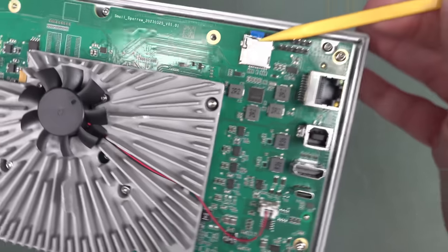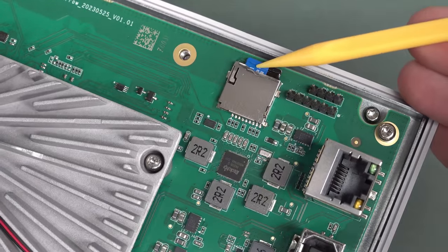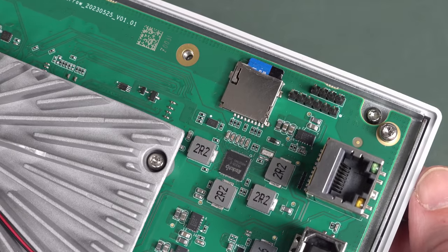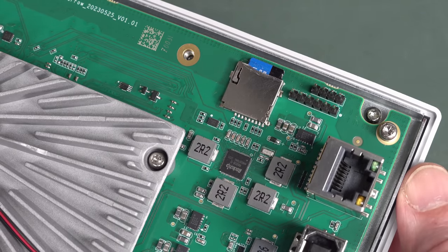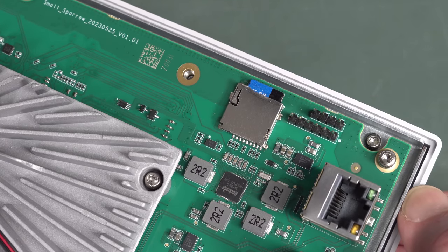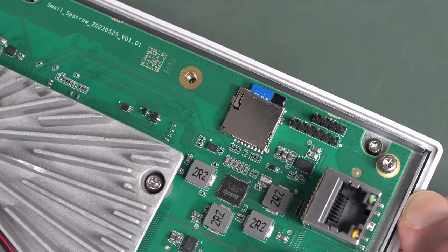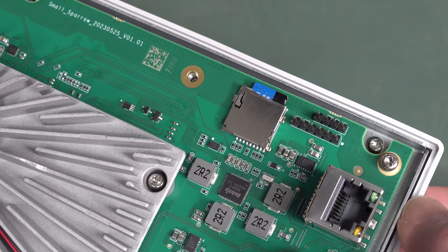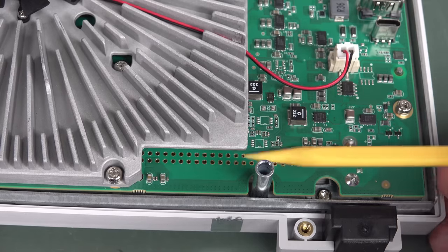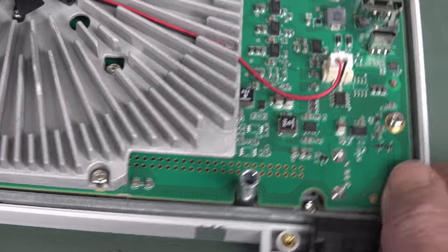Lots of power supply action happening over here. There's an SD card glued in there — they've actually glued in that SD card. That's interesting. I might have to get that out and have a read. Can we just update? Because this does run the Android operating system. Is the operating system just on the SD card? Is that a way to reduce cost? We have some headers here, and check it out — that is your logic analyzer option. The footprint is there but it's unpopulated. There are a couple more chips unpopulated down there.